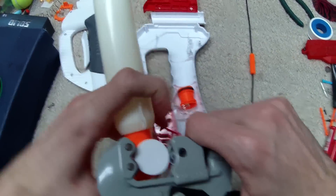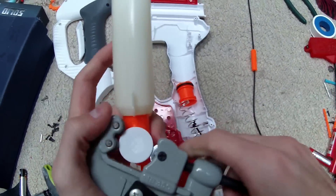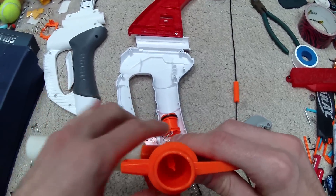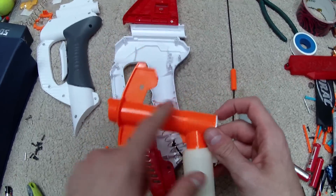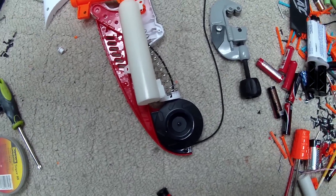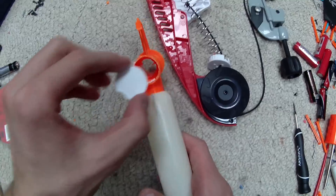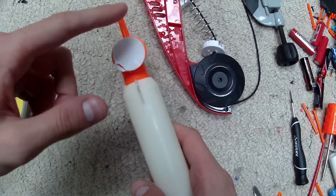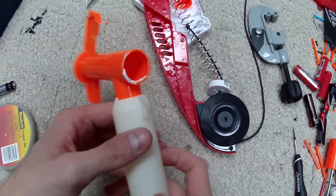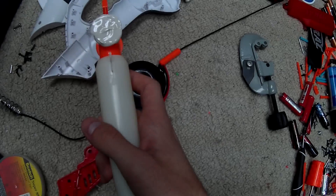I also want to touch on how I'm going to knock out the air restrictor cleanly. I'm coming in with some rotary pipe cutters and teasing the back white cap off — I have no doubt it's solvent welded on in a similar fashion, so I'm going to take it off gently so I can two-part epoxy it back into place when I'm done. After that, I'm going to blow the entire apparatus and air restrictor out through the back end, which should give us clean air delivery all the way through and ultimately a much better system.